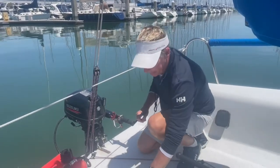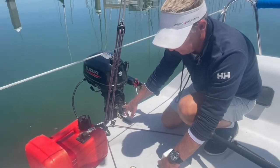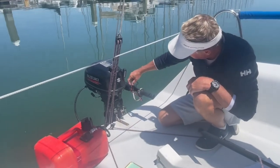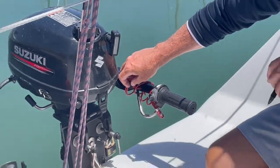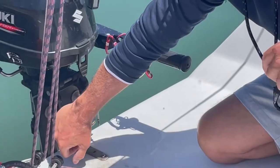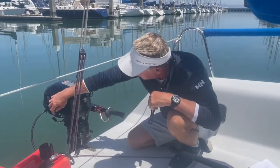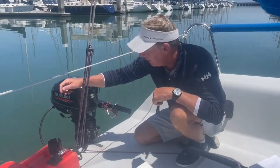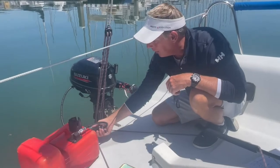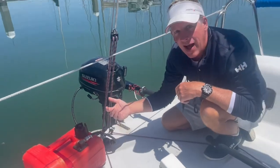A few other things to check are right on the checklist. We need to check our safety line — this boat doesn't have a traditional safety line; we've replaced that with a lock and a through bolt, which acts as our safety line. We also want to make sure our kill switch is right there, which it is. And we definitely want to check our engine mounts — these should be nice and tight; we don't want that outboard vibrating off when we're motoring out of the channel. Unlike the teaching boats, we don't have a fuel line on the side to open up because we have an external tank, and we don't have to open up this vent. But just like on the J80s, in order to prime the engine, we're going to use the priming ball here — just pump it until it's stiff. We don't want to flood the engine. Now the engine is ready to start.